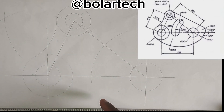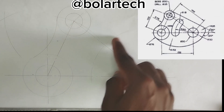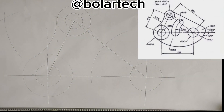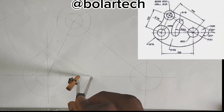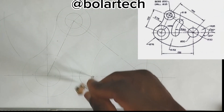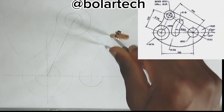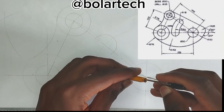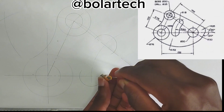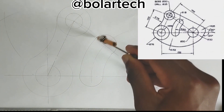Now we have been given the radius of this point — the curve at which these two parts are joining to this particular line — to be radius of 18mm. So I'm going to pick 18mm radius on my compass. At this point here, I'm going to place my compass and draw like this. Then at this point where the curve is going to join with this place also, I'm going to draw like this. So I'm going to place my compass at the center here and extend it to the length of this arc, then join these two together, extend it to this point also, and then join these two together like this.